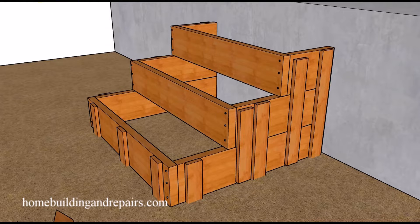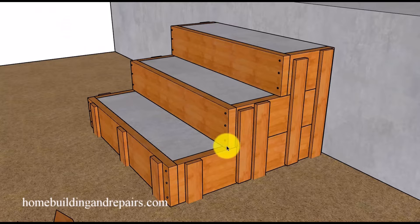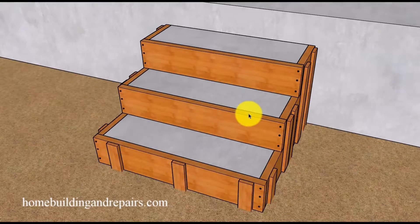Our stairway will have seven and a half inch risers, so we're going to be using two by eights for the boards and stakes, which you can usually pick up at your local lumber yard or make yourself. We'll have some stakes going into the ground and some side pieces, but you can always use additional stakes for extra structural support to keep this from moving, or drive more stakes or use fewer if that works for you.